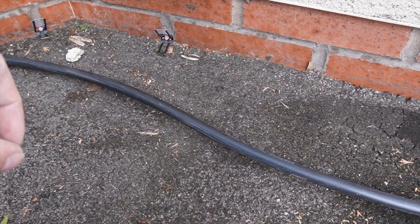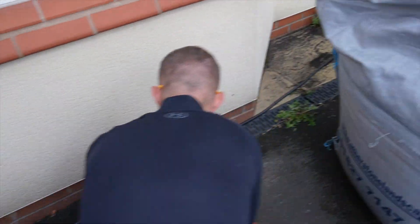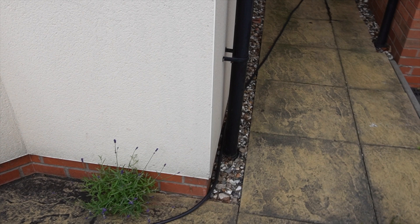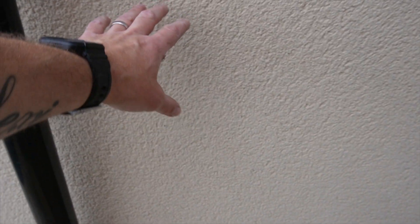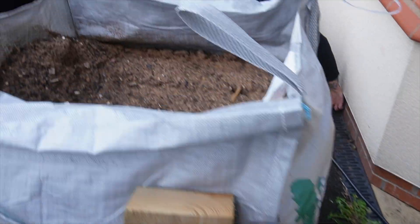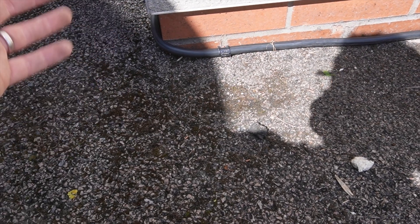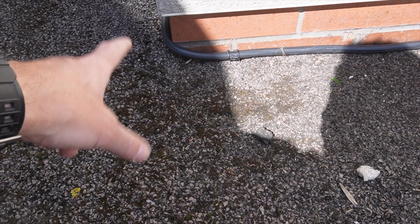We'll dress the cables in and then the EV charger is going to go above that and run round, fitting on the side just past this drain pipe. Loads to do and hopefully the weather stays nice. The cable is in and Lewis is fixing them up. On a warm day it does help, but trying to get your radiuses on for cables around a tight end — with a lower quality cable it just doesn't do that, it just splits and all sorts of stuff.